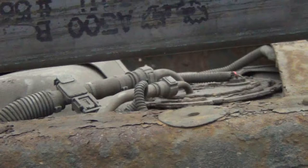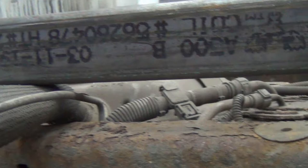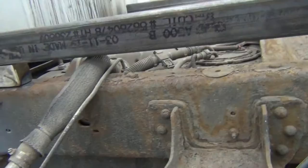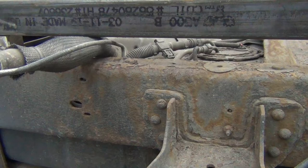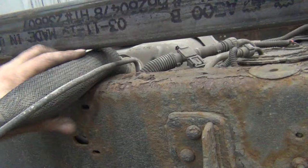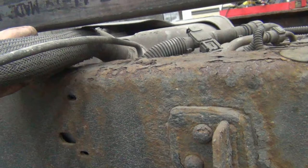The filler comes out of the tank and it's usually mounted roughly horizontal here, and we're pretty close. We would be good if the neck was going to stay in this position. However, that is going to be up by our bed. I don't know what I'm going to do yet here. I'm going to think about it for a moment and may cut that out. But I'm thinking I don't have to, because even if it's up, it's not touching. The sleeve is touching, but if I snug that down, the sleeve's not touching even in the up position.